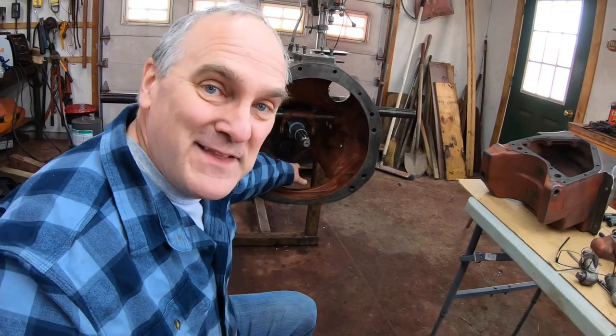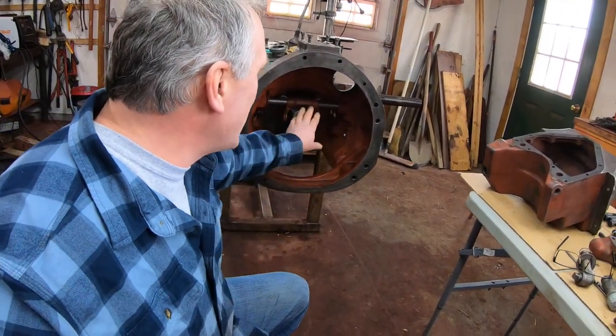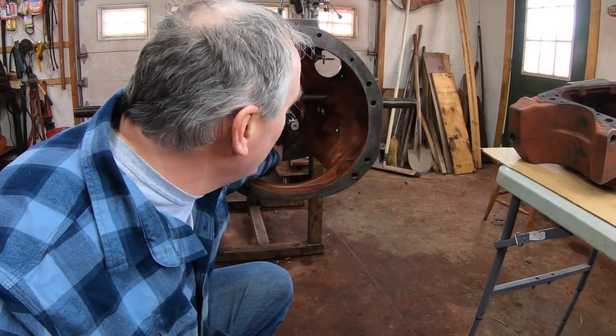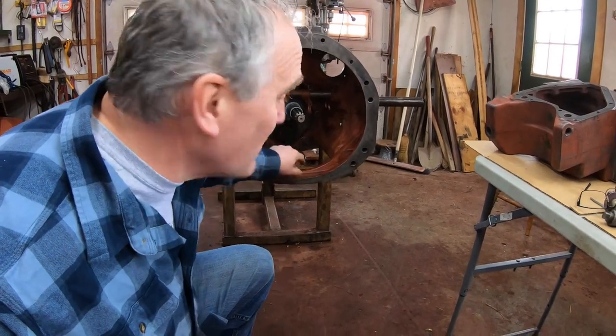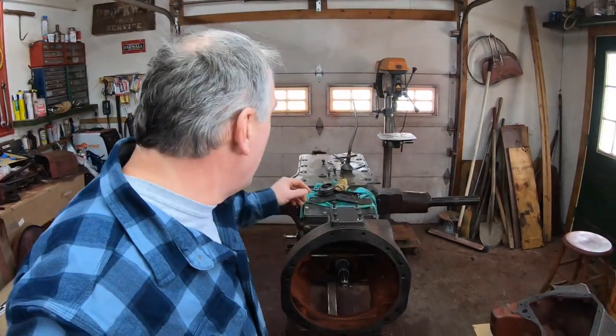This hydraulic pump is what's called a belly pump because it sits in the belly of the tractor. It sits in this opening right here, and the engine drives this shaft — the clutch shaft — back into the transmission. The hydraulic pump is actually driven off the transmission counter shaft, which rotates in the opposite direction. It's not a live pump, so when you push in the clutch, the pump stops because all the gears in the transmission stop.